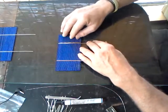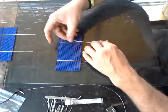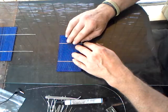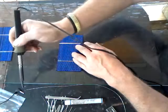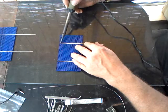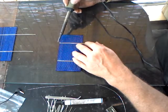I used a lot of flux on this side so I'm not going to bother refluxing it. When you get to this point, sometimes people put a little flux on the wire and sometimes they don't. I've noticed that a good amount of flux helps, but too much flux is a bad thing too. Take a little dab of solder — a little dab'll do ya.